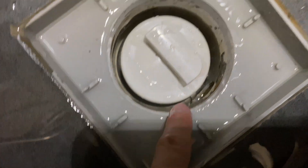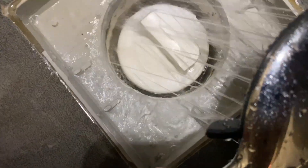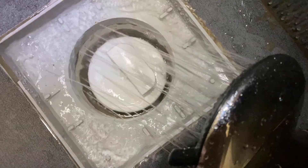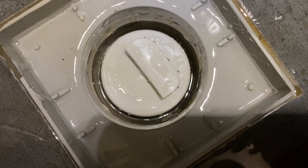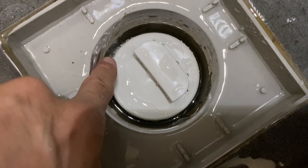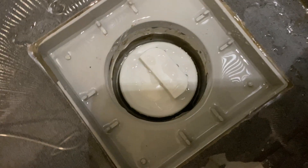I want to lock it so that I know I have indeed installed this trap properly. The last step is always to pour water into it to check if the water level rises up to the rim of this S3 trap. Again, this is not a sponsor video — if it's a good product I will buy it and test it out and let my audience know. The water level is at the brim and does not go down any further, meaning there's no leakage at all.